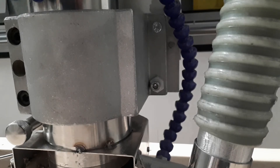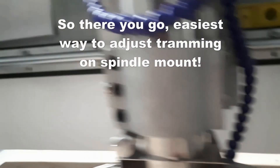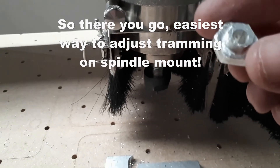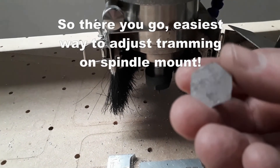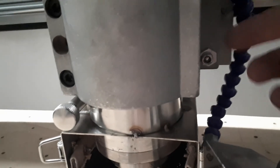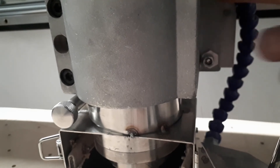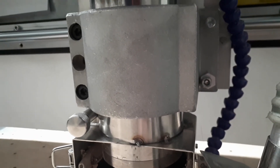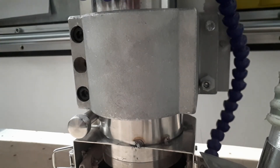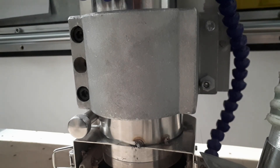It will take about three minutes in total of cutting time, if that. Easy enough to do, a little bit of tidying up depending on how clean you want it. The one I've got there I never bothered tidying up — it's functional, I'm not looking for it to be aesthetically clean. I did make the head a bit big on this one. The gap between the head of the bolt and the edge of the spindle holder was different for each hole — typically they weren't drilled exactly square. So when I measured for the ones at the top I allowed plenty of room, and of course when I came to fit it down here it didn't fit. So I've just made the new one a little bit smaller. Make yourself an eccentric nut — you'll enjoy it. Cheers.